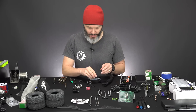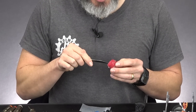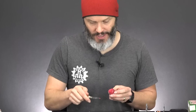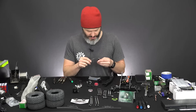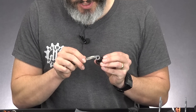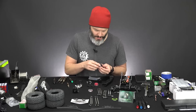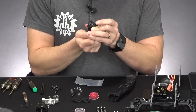Next thing is we're going to add a little bit of grease, and you really don't need to add much at all — just enough so that it gets spread around on the gears. That's probably going to be enough to spread around on all of the gear surfaces once we get things going. So I'm just going to put it in a couple of spots. These gears are actually pretty deep on the teeth — that may get eaten up quickly. We'll just try. Spin it around a few times, see how she does. Yeah, that's spread around nicely.